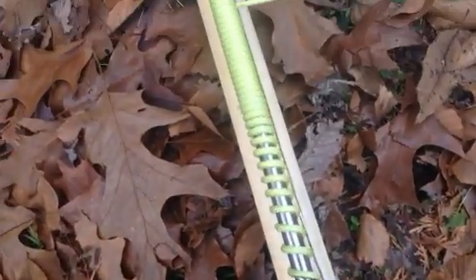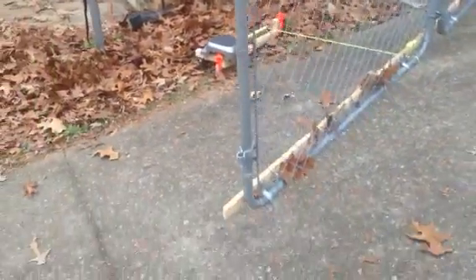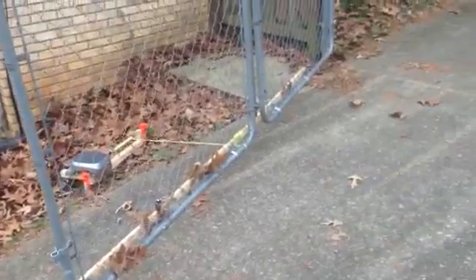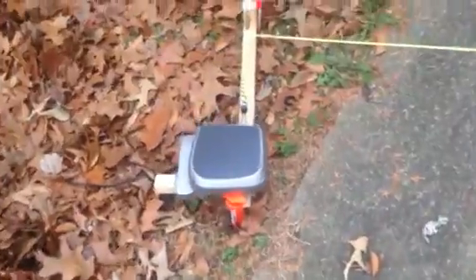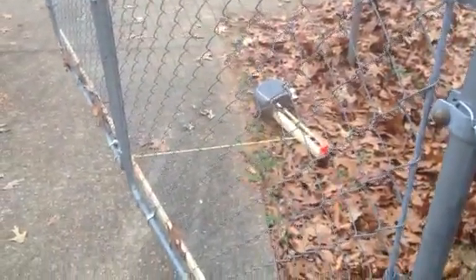You can see this motor spins, turning this long shaft, which slowly winds up this rope, and it pulls the gate open. You can see it takes about a minute for the thing to get completely open — runs a little slow. We hit stop, and now you can see the gate is locked in position; the motor's locked itself. But there's still tension on that rope because we've got these high-powered springs on top and bottom. So all we have to do, after you drive through, is just make the motor go in the opposite direction. The rope unravels, and then the springs pull the gate shut.